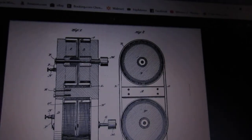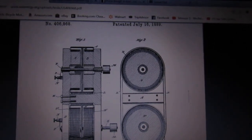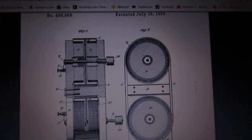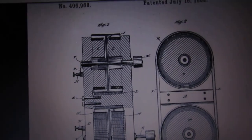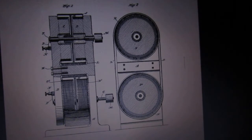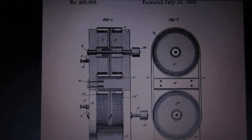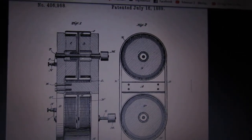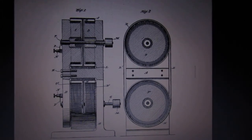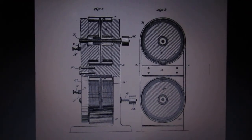That's it — pretty simple, cut and dried, and straightforward. That is my favorite of his DC generators. It's a very high current, practical DC generator. It's got a lot of copper in there, but you could use very powerful neodymium magnets and you don't have to have all that iron — it doesn't have to be so big and heavy. The thicker your copper disc and the greater your field strength, the greater your current output. The higher the flux density, the higher the voltage you'll get, but it will be a direct current of very high intensity. Hope you enjoyed the video — thanks for watching.